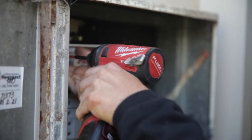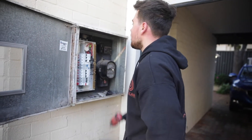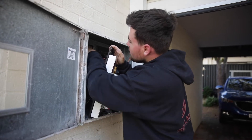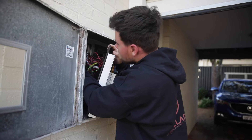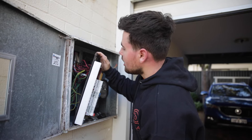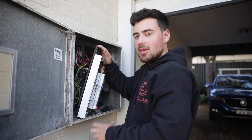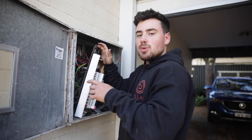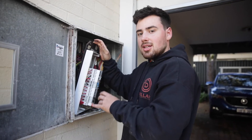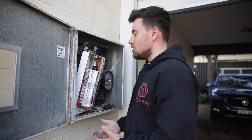So I'm just taking this one off to see if it's had the same problem as the others. It's a bit better because you can see some of the TPS cable, though we still have some going up into conduits from when it was originally built. At least one good one out of the six — you can actually see the cable, so we can match up the active and the neutral for that circuit. On all the others we can see the actives going into the old circuit breakers, but the neutral just goes straight to the bar, so we can't match up what goes to what.